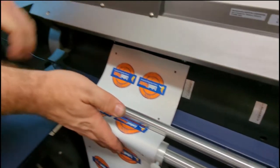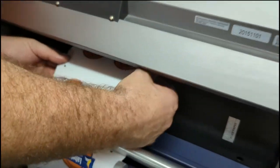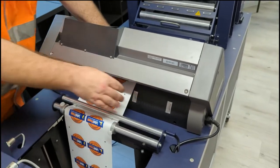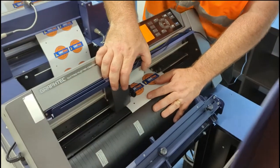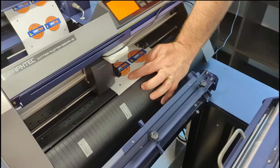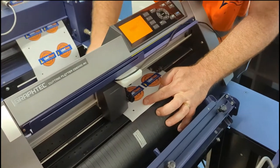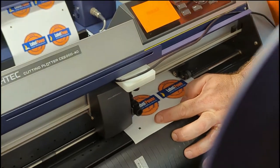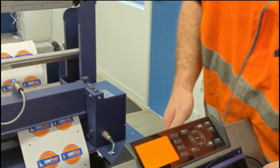Open it and roll up to the cutting head, push it down, and feed it into the machine. On the machine you'll see we've got the camera here, so we'll roughly line up to the first black mark. You've got the pressure rollers — while they're disengaged, you want them just near either edge so they're nicely even apart. Then click the rollers in place so it's nice and straight.